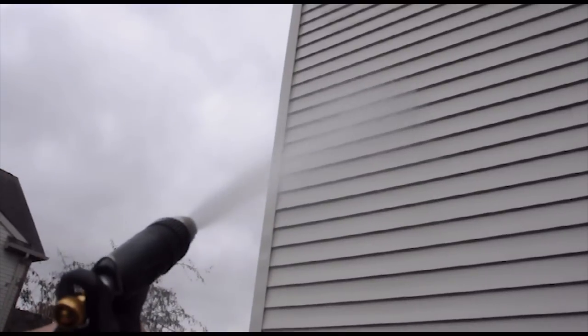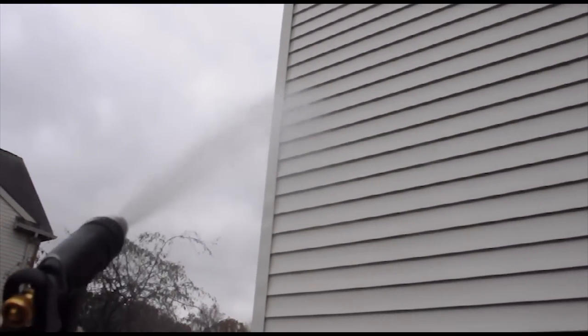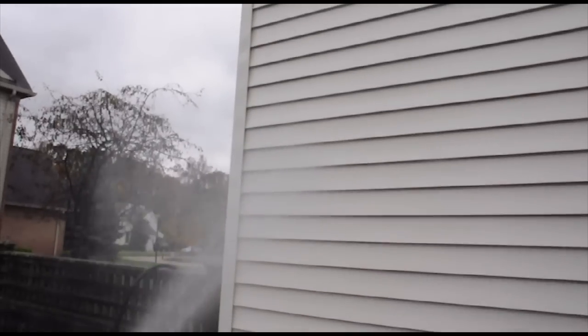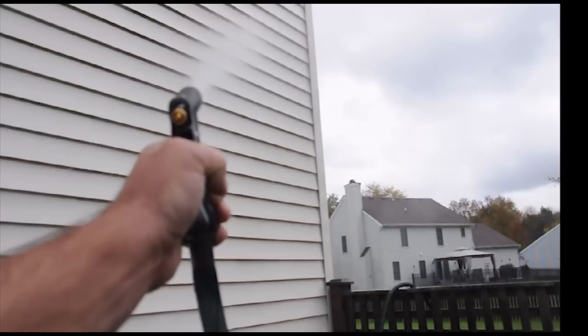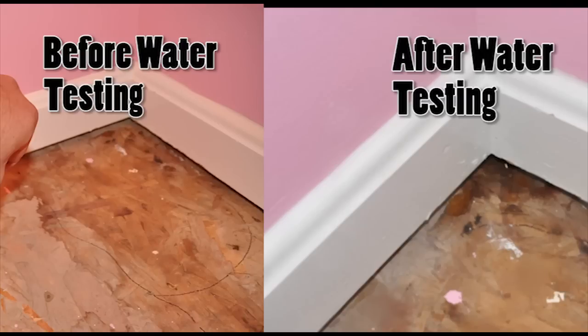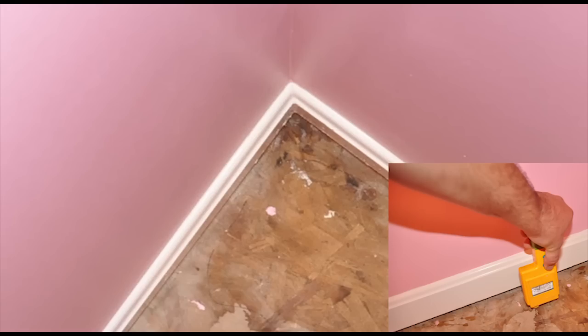We continued to water test the back of the home — the upper siding, the lower siding, and even underneath the vinyl siding. It wasn't until we water tested the corner that we realized some water intrusion. The dining room floor stain became larger and the floor moisture content increased. Below the dining room, the band-joist pockets also became visually moist.